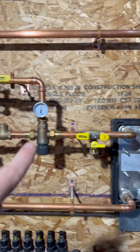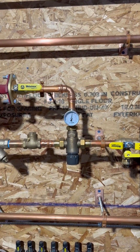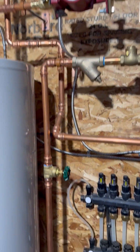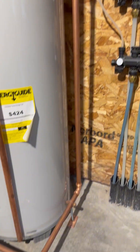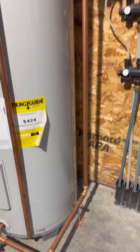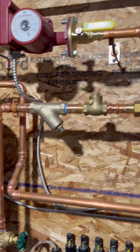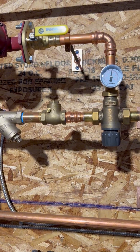Out of my plate exchanger I have a mixing valve. In order to have cold water to dilute that down, I'm actually pulling water from the very bottom of the tank. Since you're pulling water from the bottom of the tank you're going to have more sediment, so there is a strainer and also a check valve on there.